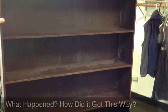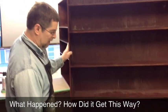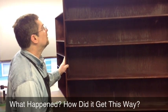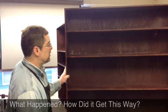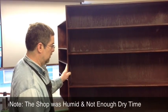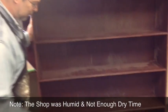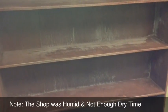What was rough? The surface. I don't think that the wood was actually properly prepared for the stain. Yeah? I don't think that it was sanded well enough. Uh-huh, so you have like little hairs? Yeah, so the stain caused the wood to swell up a little bit, made it even rougher, and then he couldn't sand that at that point, so when he put on the finish, it just got even rougher.